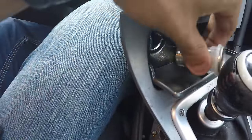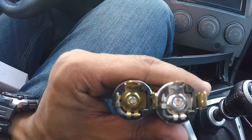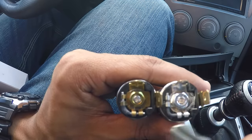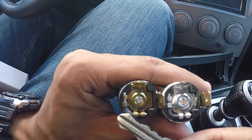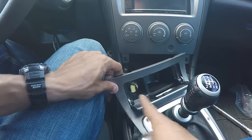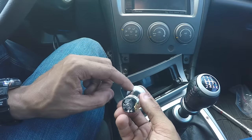The front half will pop out as well. Here is a side-by-side comparison of both outlets — on the left-hand side I have my old outlet and on the right-hand side I have my new one. You can see this is the link I was talking about right here; it acts as a fuse if it gets too hot and will actually burn out. On the left-hand side, on my old outlet, you can see that it is much thicker, which indicates that it got very hot and distorted the insulation around the wire.